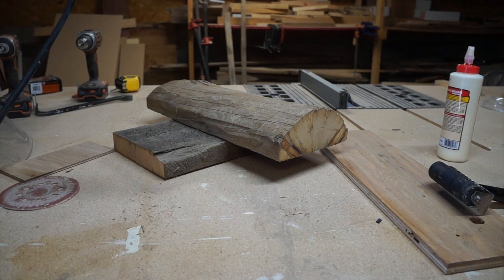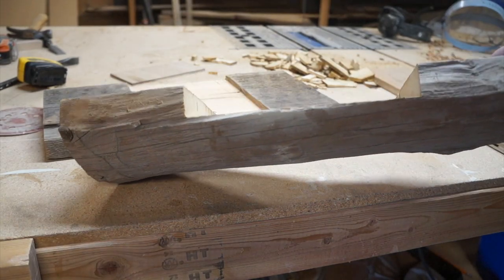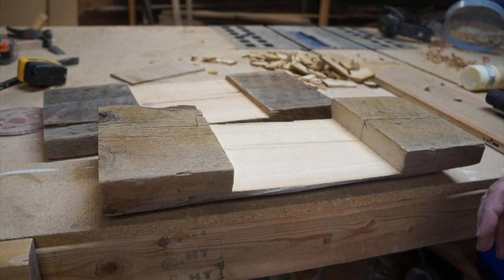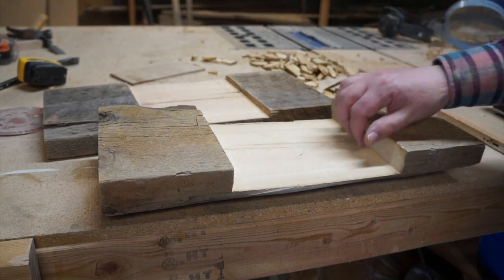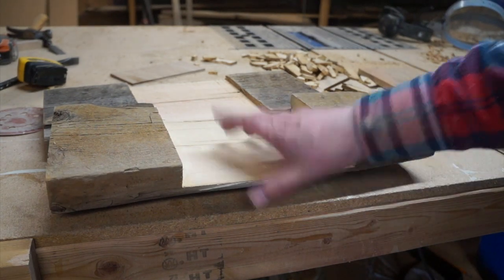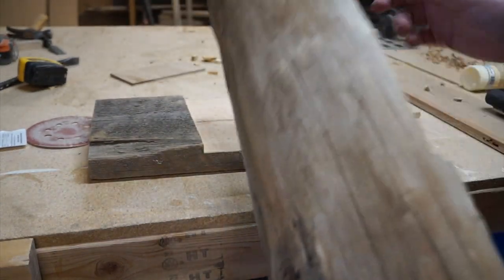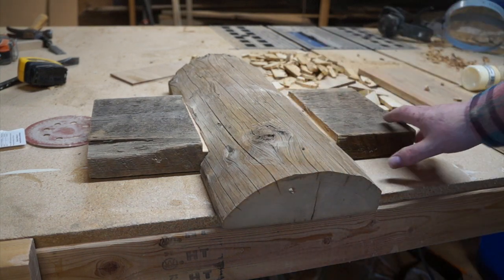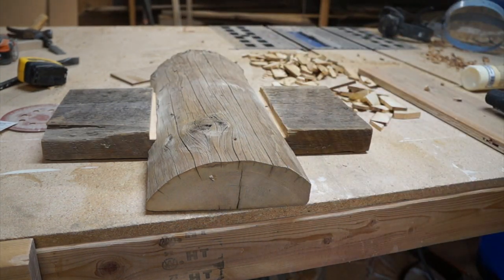It's pretty substantial but so is the rest of the tree. I measured and cut out this notch on the table saw. If you have a dado blade that's awesome, or you can do it with the router table. I just cut a lot of slits, then take a hammer and knock them out, and clean up the bottom with a chisel and sander. Because one piece is round, I measured the thickness of the base from the edge, not from where it's round, so I end up with a little extra here — but that's okay.